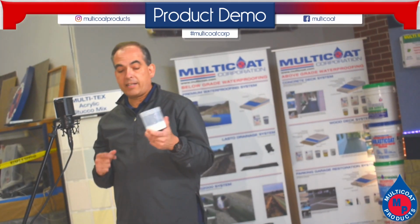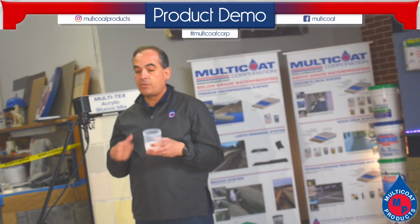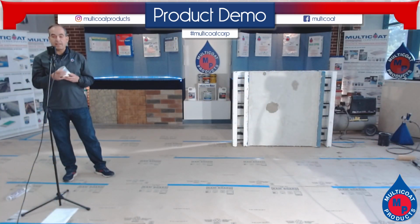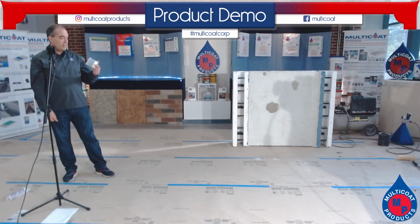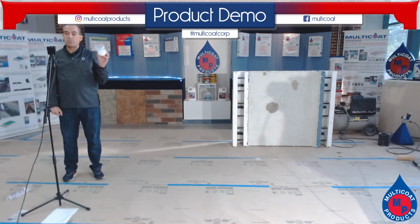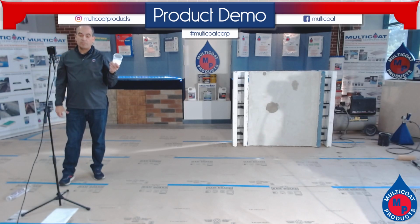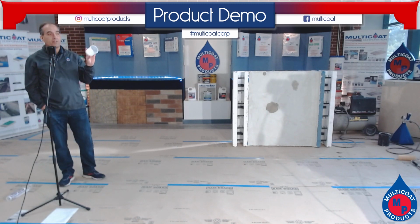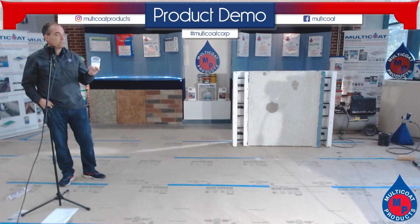It is a great product. It is great insurance for anybody doing overlays, epoxies, pool products, because it will help. It's easy to spray, you can start working on it immediately in a pool, and it will block hydrostatic pressure coming through your gunite or shotcrete in order to protect your plaster or PebbleTech.